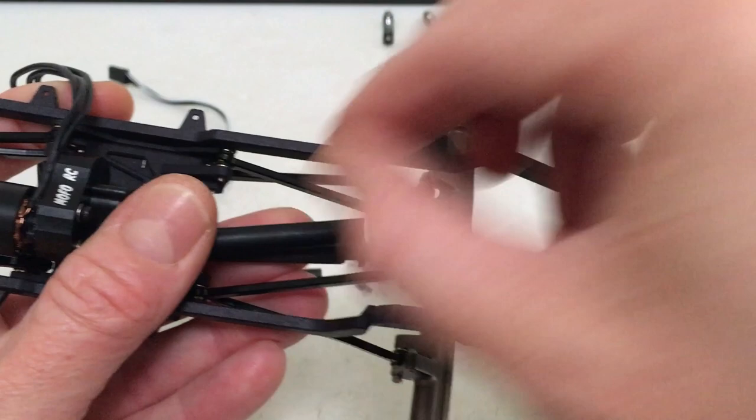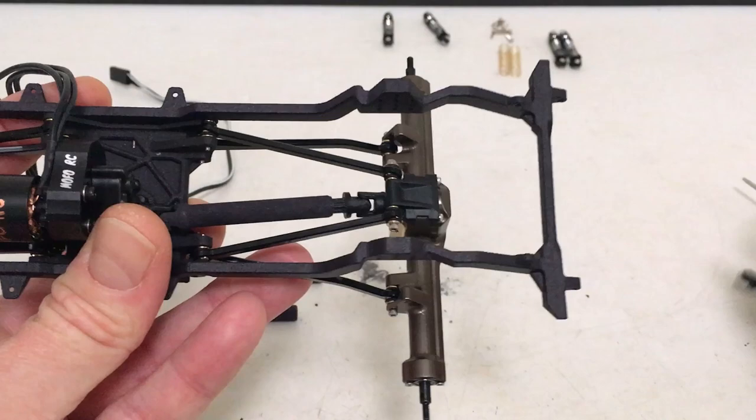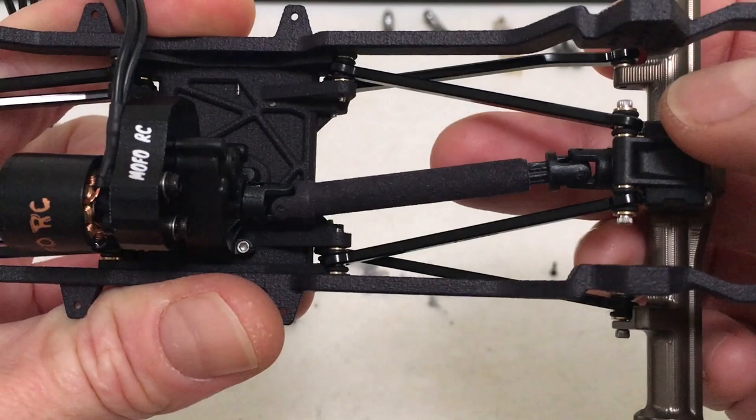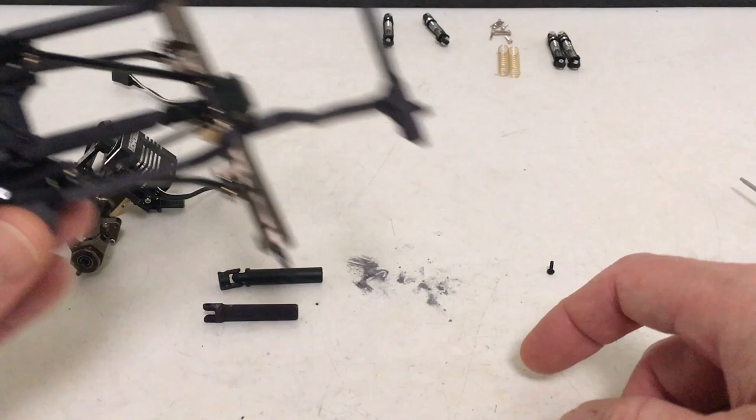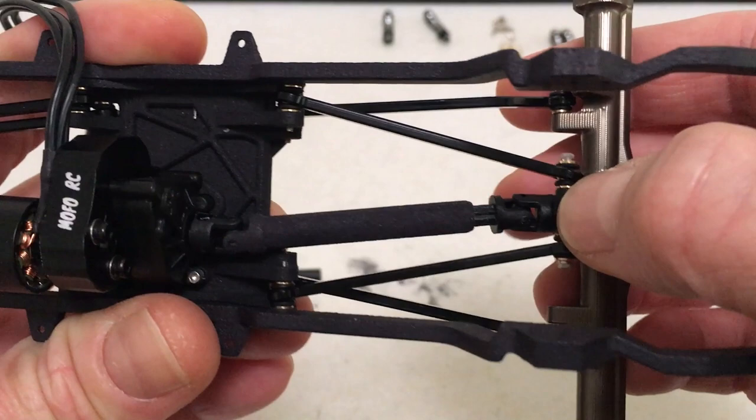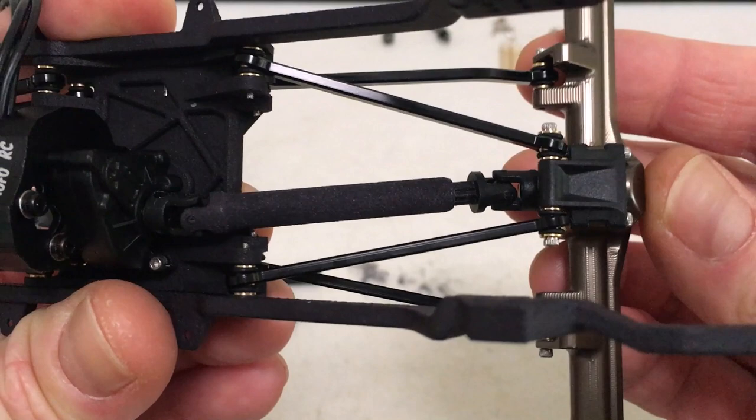So I went back to revisit the drive shaft they provide. I was able to take a tool, run it up in here, and there was basically a bunch of plastic and center kind of print stuff in there, and then tap that out on the table. That's what all this dust and junk is. And that was able to give me full engagement. You can see here, it's engaged a lot further than it was, and there's really not a lot of movement. It's very slight with the amount of travel of this axle.